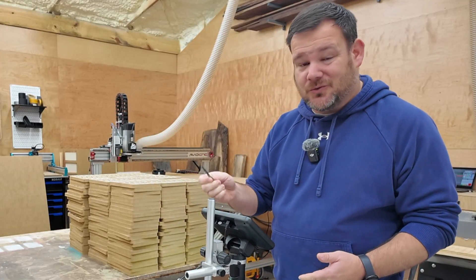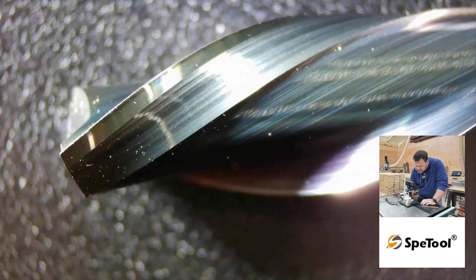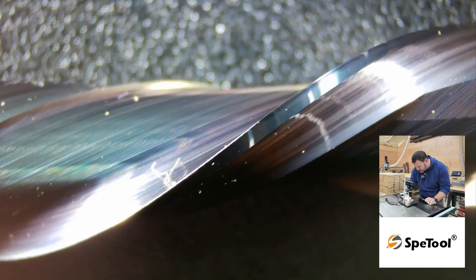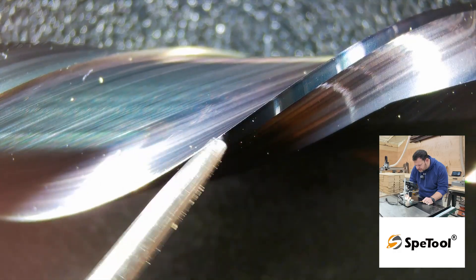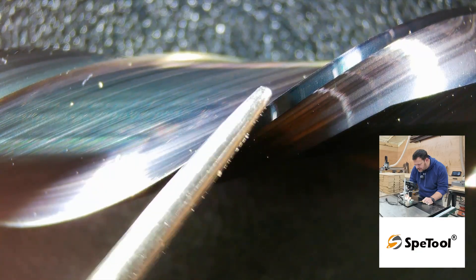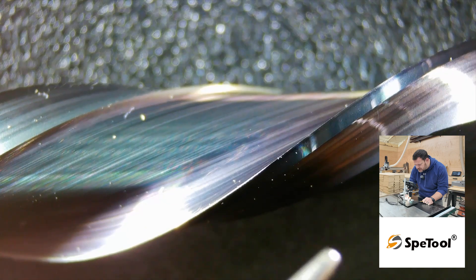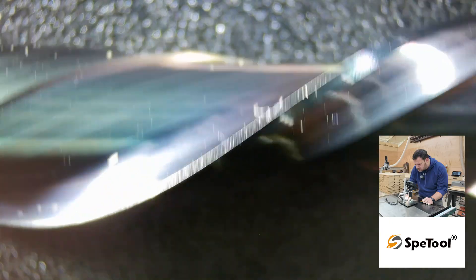Let's look at Speed Tool under the microscope first. I'm not seeing a whole lot of difference. We'll put on screen what it looked like out of the package versus now. A good indication is the changeover line — that's how deep we're cutting. The flutes above are unused and haven't been cutting. Below that line, you can see the edge is starting to round, but overall that's all I'm seeing.